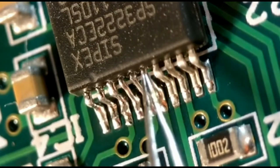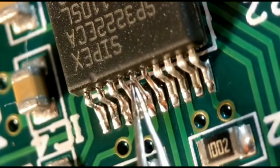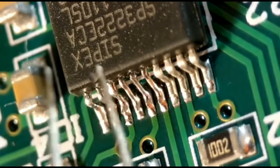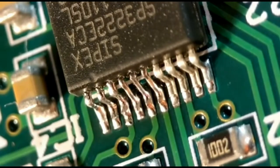When I used the scalpel blade to break the Kynar wire earlier — the camera angle may have blocked the view — all you do is put your scalpel blade right on the join and wiggle the Kynar until it breaks. It's hard to do with cutters, so you're better off with a blade. I hope you learned something, save a few ICs, and keep your projects going. If you liked this video, please subscribe and give us a like — thanks a lot for watching.